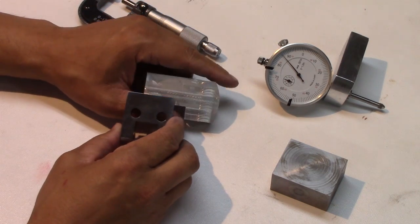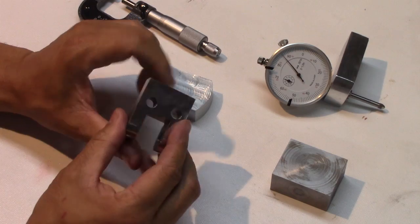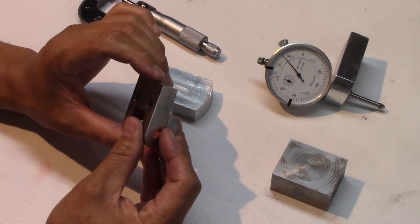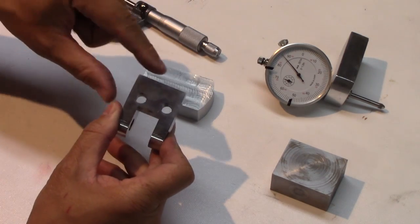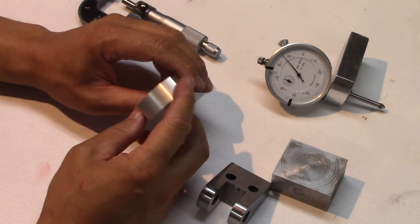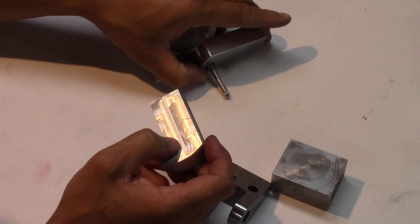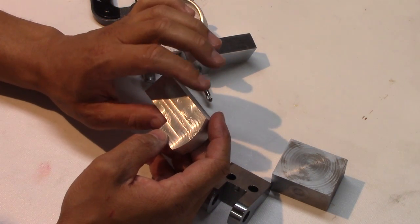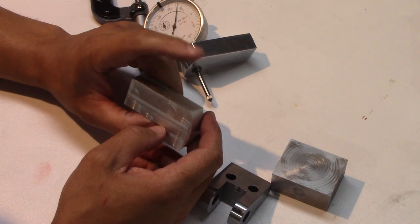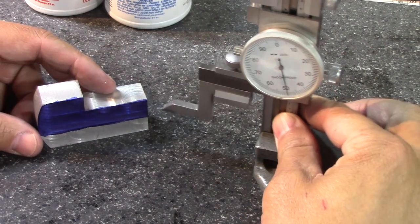What I did is I re-milled off some of this, made it fit on the lathe so that this spindle goes where it's supposed to. I had to take off about a quarter inch here. Now I'm thinking about a redesign on how to clamp it onto the lathe bed, because these two holes are actually over the bed so you can't clamp it with those. I thought about using a notch and a set screw on the top to mount it on there. On this one, instead of using rare earth magnets to hold it like the previous version, I decided to try a set screw approach. This is just an experiment, so we'll see if we can make this thing work.